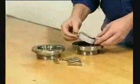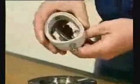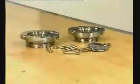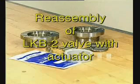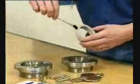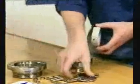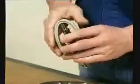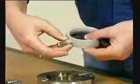Take out the valve disc with seal ring. Remove both bushes from the disc stems. Take off the seal ring. Lubricate the seal ring. Fit the seal ring on the valve disc. Fit the bushes on the valve disc stems.